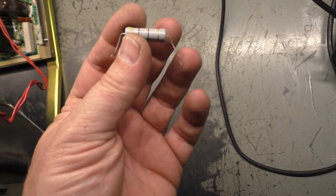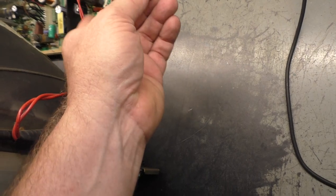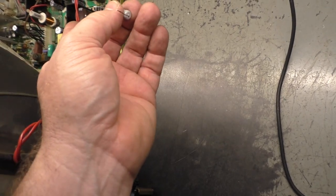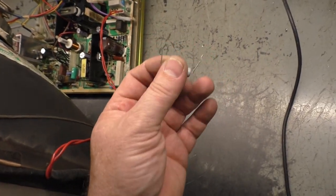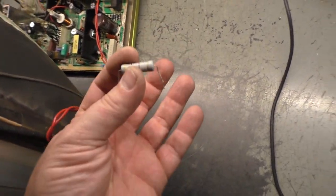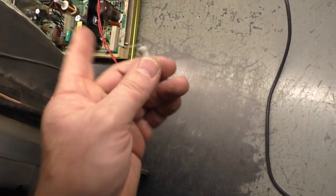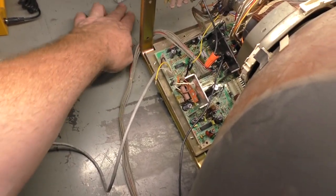That's not a big deal, but this resistor that I added to the power supply, I thought that might have been part of the problem. So I took that resistor back out, and it doesn't appear to really do anything. I don't think that was supposed to be in there anyway, because this is a 27-inch, and there's a mod there with the diodes that may not even need this resistor. I'm sure nobody cut it out, because this was obviously running for a very long time based off the dirt and the dust without that resistor. So I'm going to leave it out. I thought this might have been the reason for the not discharging, but it still doesn't discharge. I'm not really worried about it. I'm not going to even probably troubleshoot it, because it doesn't affect the operation of the chassis.